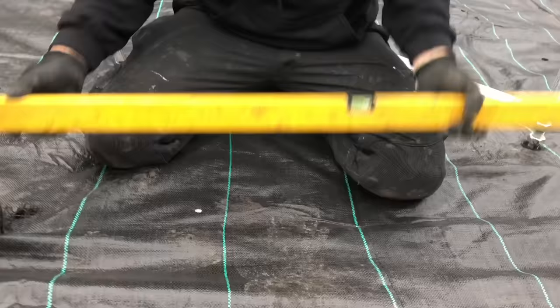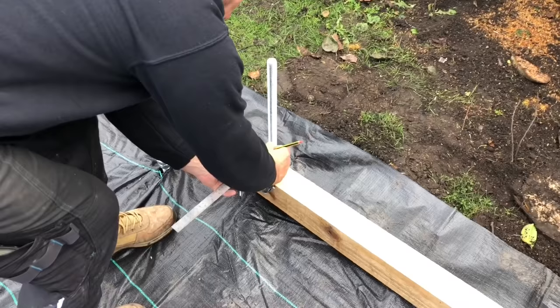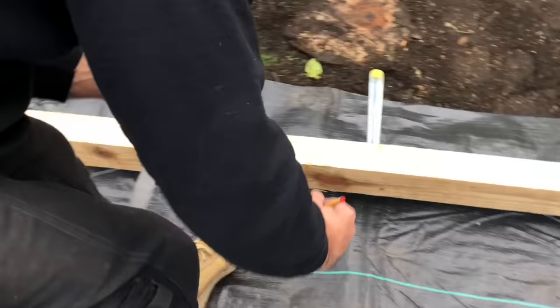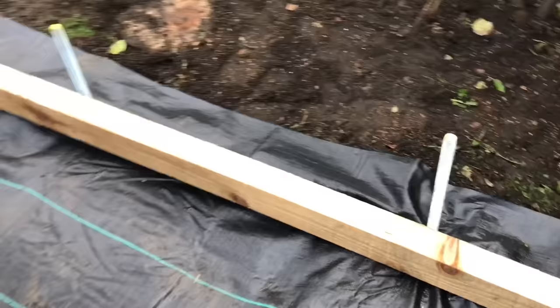And then what he'd do then, if he was going to do his next one, he will then rotate the level, just in case the level's out, and it'll always rectify itself. Lay the four by three in front of the rods like that, and then what I'll do then is I'll transfer the centre of the line across, use the square to find the centre in the timber, and then that mark there is where I'll drill my 25mm hole through. So I'll do that all the way down, like such.